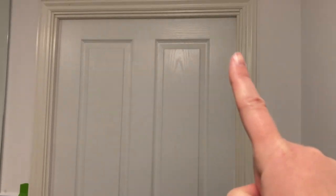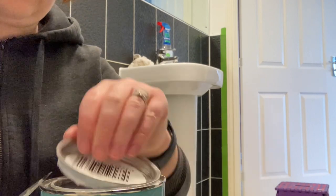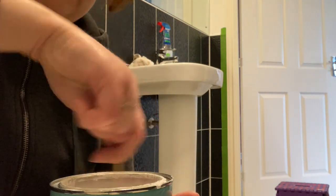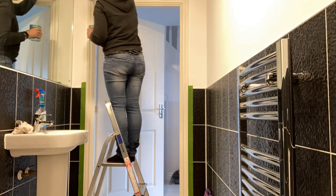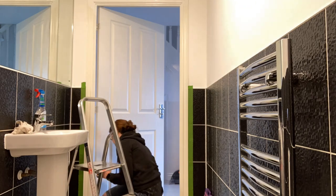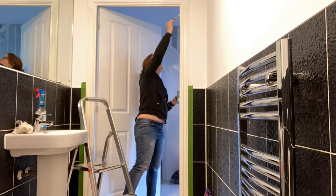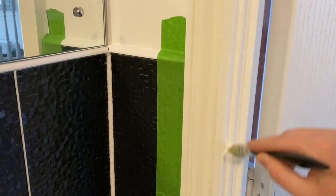There's no need to mask around the areas at the top as those walls are going to be painted. I used a brilliant white satin wood for door frames and skirting as it gives a lovely low sheen finish. I always make sure to stir the paint even when it's water based like this one. When painting the woodwork I always get the paint on and glide over it with the brush to avoid patches and obvious brush marks — it kind of blends in that way.